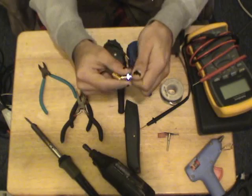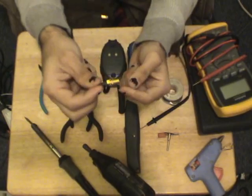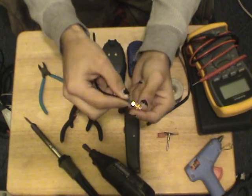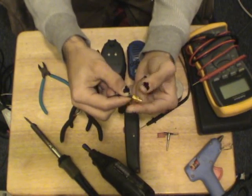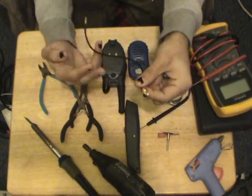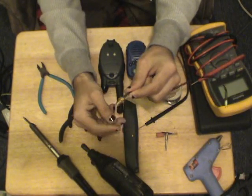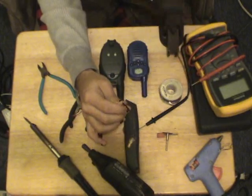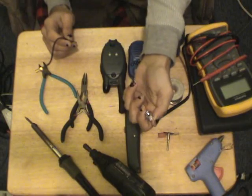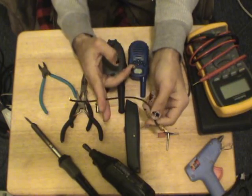But if you notice, both of these connectors look exactly like the Wi-Fi ones that we've been working with in the past. They've got these little nuts and washers on them that allow us to mount it into your device. Now the one thing I like about this is actually a GPS cable. This goes from an MCX to a standard polarity or just a regular SMA jack. You can buy these things off eBay pretty cheap. It's kind of hard to find panel mount female BNC jacks, so you might actually just be stuck buying one of these cables and then sacrificing it. You'll probably just cut it about there and splice it in.